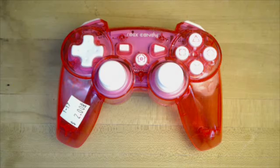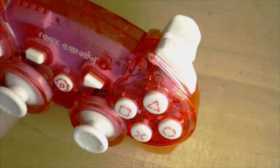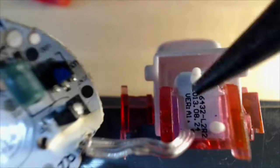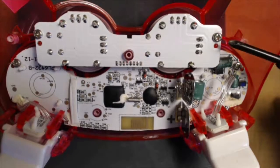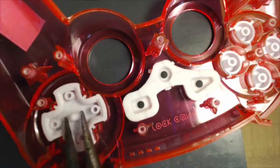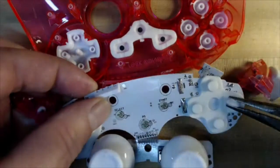This controller is full-sized. It fits my hands better than the other two, and it has almost the same controls as the previous model. It's got slightly different center controls and a larger paddle-shaped lower button on the front panel, but very similar. The case is a simple two-piece shell, and in this controller all four of the front buttons are separate. One pair are in an enclosed case that sits in a slot, and the other front buttons are on separate mini-boards — more wires to deal with, but the same functions as the last one. The joysticks are also on a separate daughterboard. The top buttons and four-way rocker use separate hard-shell covers. The three center buttons are squishy elastomerics with one hardcover added for tactile feedback.